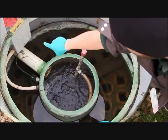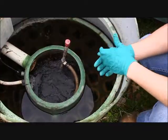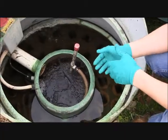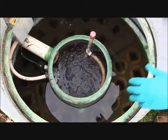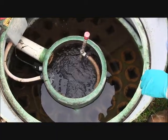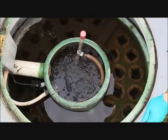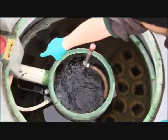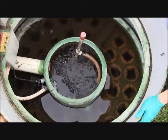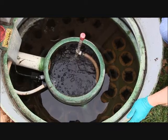We also check the electrical connections for the motor to ensure those are intact. This aerator runs 24 hours a day and this one is functioning properly. The aerator provides the bulk of the treatment for the multi-flow unit. The socks, which are divided into three banks, allow for the growth of beneficial bacteria, which assist in the treatment process.